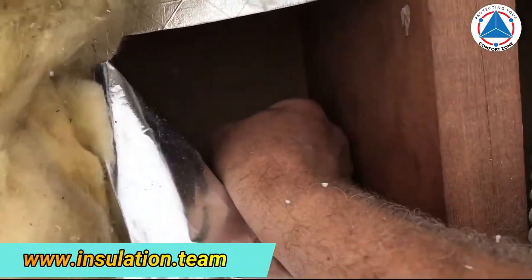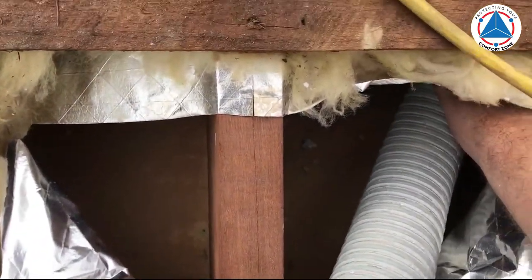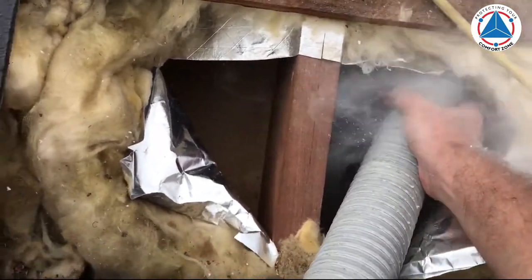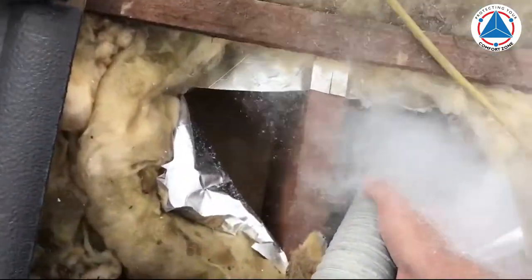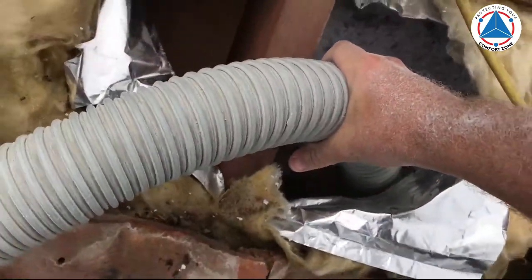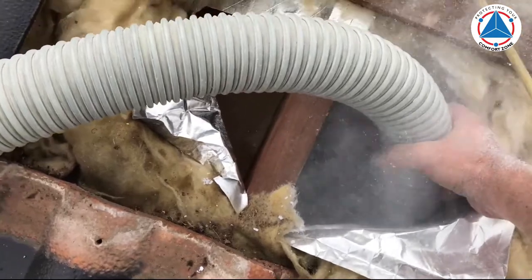You can see that joist itself is about eight inches high. So if we fill this bay up we've got eight inches of material in here, but we're not trying to actually fill it completely, because if it's very full it'd be about an R6 and we don't need R6 — we're just trying to put four inches in there. Unfortunately, because we can't see very well in here while we're pumping, we tend to end up putting between six and eight inches in, even though we tell customers it's only going to be four inches.